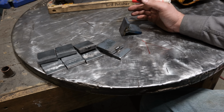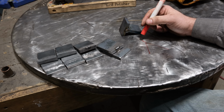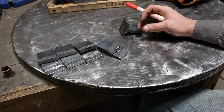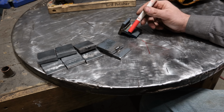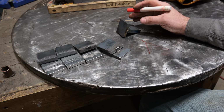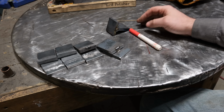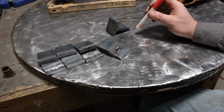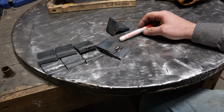Now, even with that said, the TIG weld hit 3 tons, about 6,000 pounds pushing down on that, which is pretty amazing when you think of it. Had that been fully welded out, that little weld would have easily been able to handle this being bent significantly without failure. So pretty amazing how strong even small TIG welds can be because of how perfect and uniform that fusion is. But anyways, with all that said, I had some fun doing this, and I got to say the JB Weld is stronger than I would have thought, but it's no substitute for even brazing for that matter.